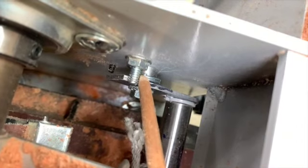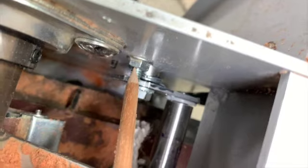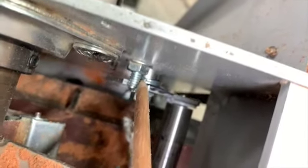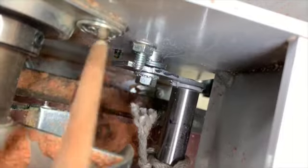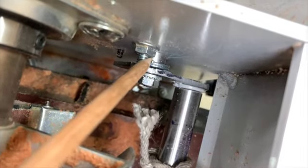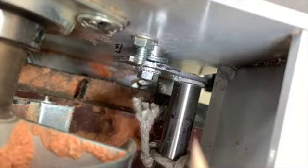But the big trick that I found, in order to get that spring right there to come to tension, you're best off to pull this bolt completely. Just take it right out of the way. And then when you reassemble this and get the nut on it, the tip of that torsion spring will be back here somewhere behind that nut, and you just keep threading it in and threading it in, and as you get closer you'll be able to push that spring back out of the way with a narrow screwdriver or something, and you'll be able to get that together.